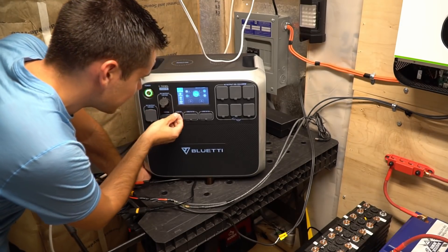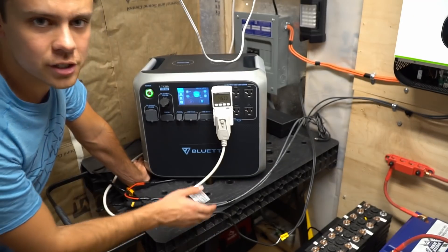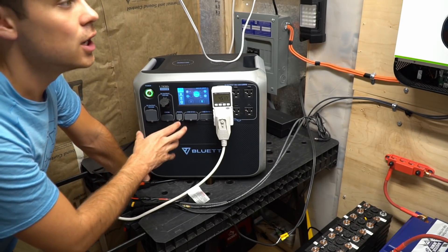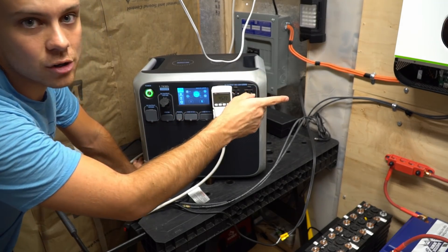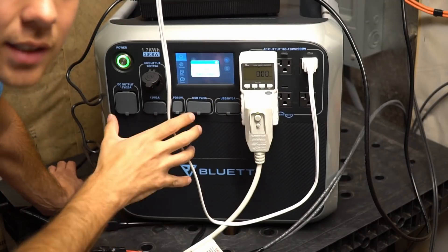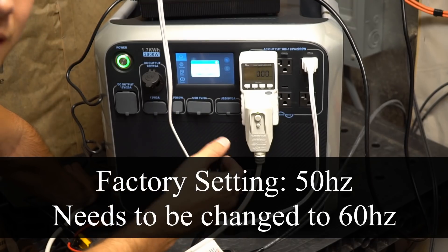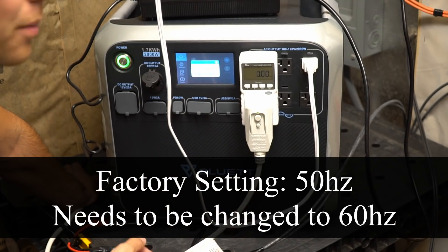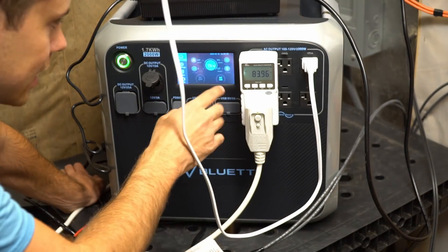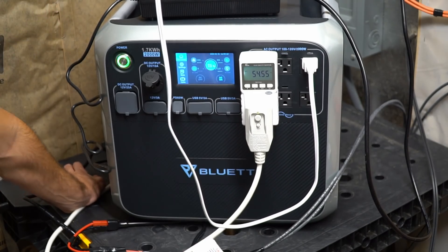I really like this thing — it's sweet. I do not like these plastic covers so I just remove them. Unfortunately this solar array is not producing enough power every day to power the air conditioner, so we're also going to be AC charging 24 hours a day with my main system inside the solar shed. I just realized the inverter is set to 50 hertz — you need to turn the inverter off, set the settings to 60 hertz, and then turn it back on again. Now we're charging with solar and an AC adapter at the same time and powering the air conditioner. Let's come back in a month and see what happens.